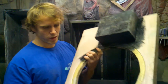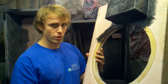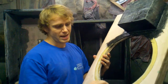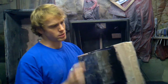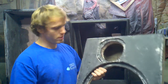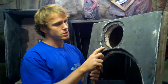What I did is I routed out the area for a plywood ring to mount in here. That way, when the screws go in, they'll have something really solid to grab onto. And it's just a 1-inch ring thickness, so it's really light — it doesn't add a lot of weight. This is the mid-range chamber, just epoxy that to the back of it. On the front, the woofer's going to be recessed about an inch, and the mid is recessed too.